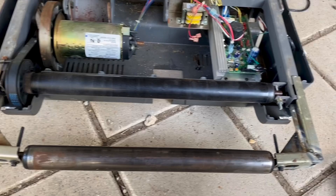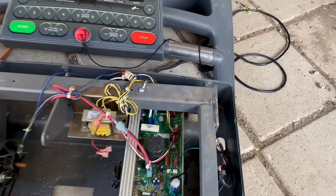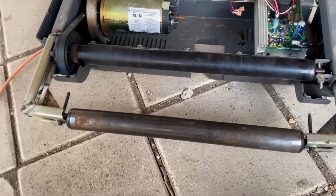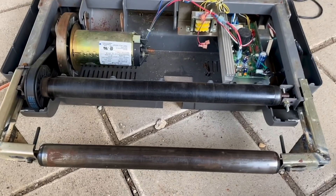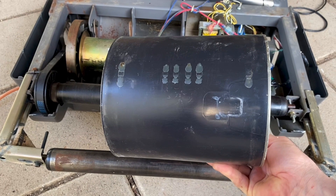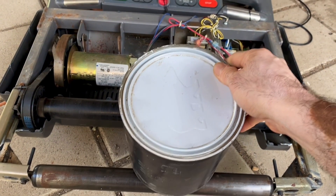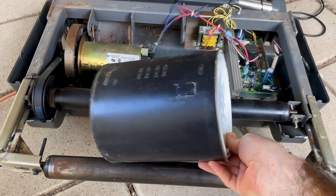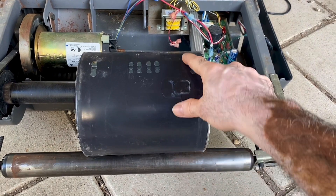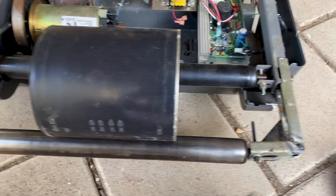We'll put a 4x4 there. And what's a ball mill without a drum? So how do you get the drum? That's my drum — flip it over and you'll recognize it: your good old trusty paint can. I cut off the tabs from both sides — it's a plastic one — removed the wrapper, and that becomes my drum. That drum sits right between the two rollers.